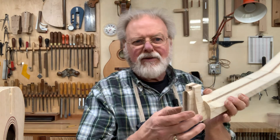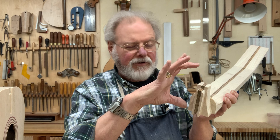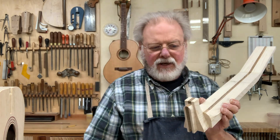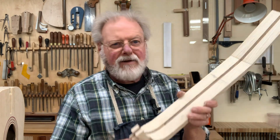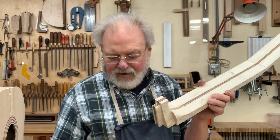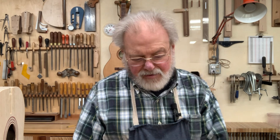There are a lot of factors that affect that curve — the depth of that heel in the first place, aesthetic concerns, and stuff like that. But today I thought I'm going to sweep three of these, and I could lay them out with a template and cut them out with a coping saw. It really doesn't take very long to do it.